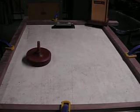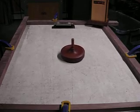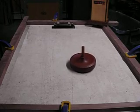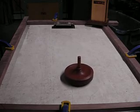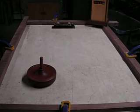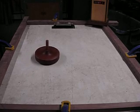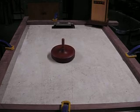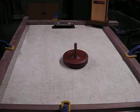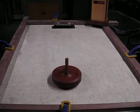This is a top made out of Jarrah from Australia. It's got a band of lead in it that's like 3/8 by half, in the outer rim. The thing is made in 2 halves, and on the bottom of it there's a brass insert and a bearing, a 3/16 hardened ball pressed into there, for a wear point rather than a direct point.